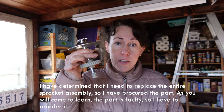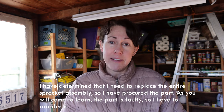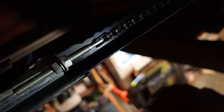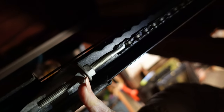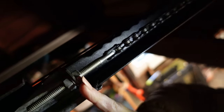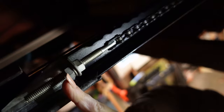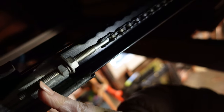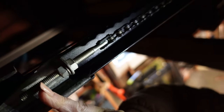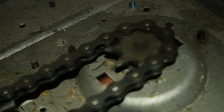Let's do this thing — we're going to install this and get this garage door opener working. I have to loosen this chain in order to get it off the sprocket on the other end. This bolt right here is the one I need to loosen, so I'm going to clamp a vice grip to this side to give me some leverage and then crank on this one. See how I have some play here — only go out maybe an inch. Do not try to take it off completely; this thing will pop. Just give yourself maybe an inch of play and you should be able to pop the chain off the other end.